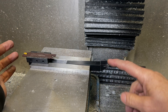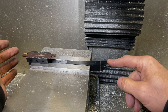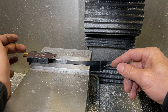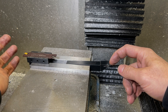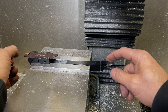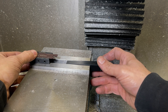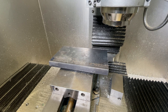In the case of having more than one tool and running Mach 4 native lathe profile, we have an issue of lining up our tool offset. Unless the tip of both tools are in perfect line, which is achievable by putting a bunch of spacers and making it work for a rare job, it's very difficult to set up a multi-tool lathe operation in native Mach 4 profile.